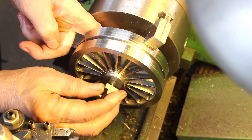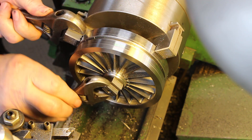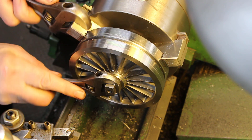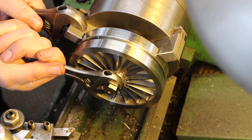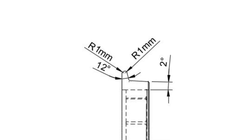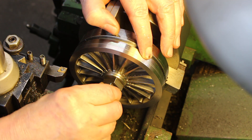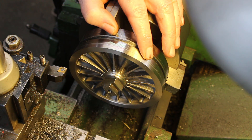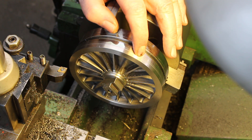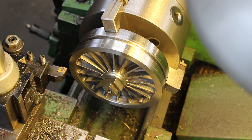I'm just using T-nuts for nuts — nice and tight. This is the profile I'm aiming for, so I'm initially going to rough it out to this profile. As I'm only holding it on with one central bolt, I'm just going to take very light cuts — half a millimetre on diameter each pass — so it's going to take a little while, but better to be safe than sorry.